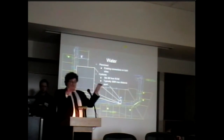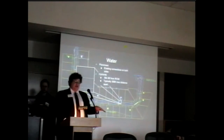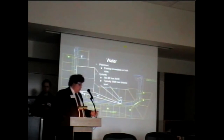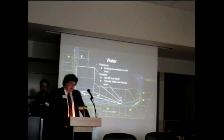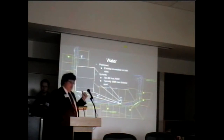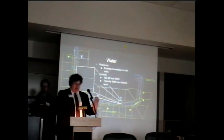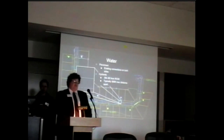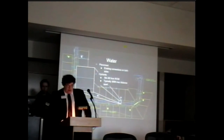So basically, if you straighten out the entire road, you're going to have the west connection on the top and the east connection on the bottom. So it's unfortunately going to have to cross. We put hydrants. They got to be 8 feet minimum due to Georgetown standards from the right-of-way inward. They are typically 350 feet maximum distance apart from each other, so we'll stick with that. Pretty good. Next.